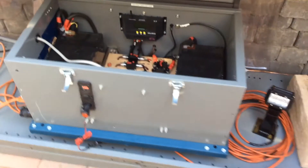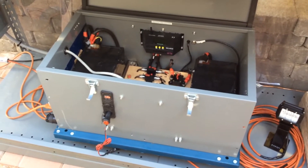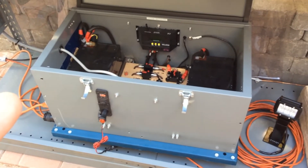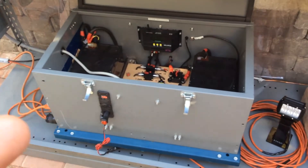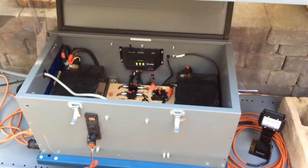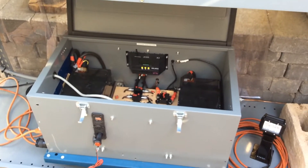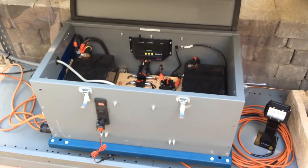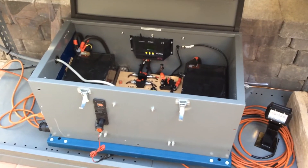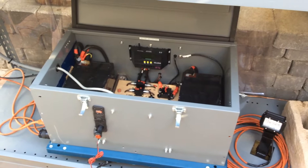Now what can I run in portable mode? I only have a 100-watt solar panel, so I'm only going to produce about 550 to 600 watt hours a day. At night, let's say I run this thing at 500 watts. I'm going to need about 750 watt hours during the day just to bring those batteries all the way back up to full. If I throw my 100-watt solar panel out there while camping or tailgating, I can run about 300 to 400 watt hours at night. During the day, running a stereo and stuff like that isn't going to affect it — it'll charge back up.